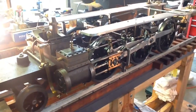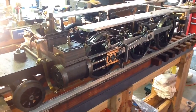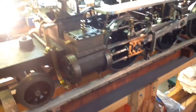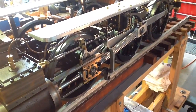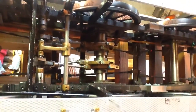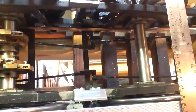Here's the chassis over here. I wanted to take a little time since I haven't worked on the locomotive in a while, just to methodically go through it. There were a ton of little things I wanted to do - namely installing cotter pins, my mechanical cylinder drains, and putting some blue Loctite on a lot of the little bolts that don't have lock washers, just to make sure they don't rattle loose. You can see the little dabs of blue Loctite on the eccentric straps and other places where there was no lock washer.